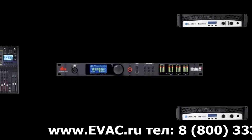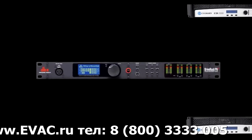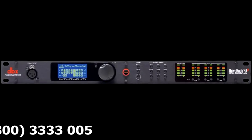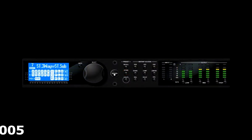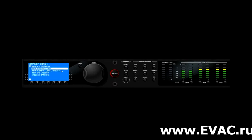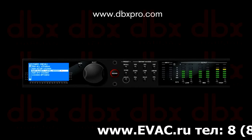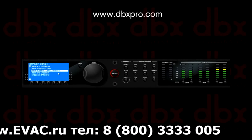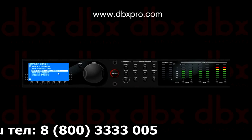If you cannot reach the desired amount of gain, your system may not be adequate for the size of the venue. Once you've completed this procedure, you can run the auto EQ. After running the auto EQ, you may also need to recheck and readjust the amplifier's attenuators and limiters due to the change in gain from the graphic EQ. You can also run the AFS wizard if needed.